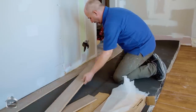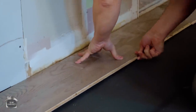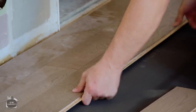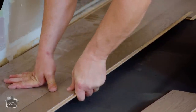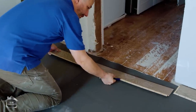This is almost ridiculously easy — this is hardwood without tools. You want to make sure you're always staggering your joints. Don't have them any closer than six inches to each other — that'll keep everything nice and square and you won't get unsightly gaps down the road.